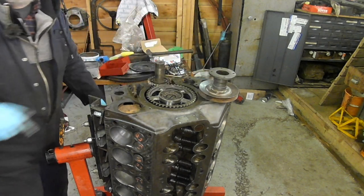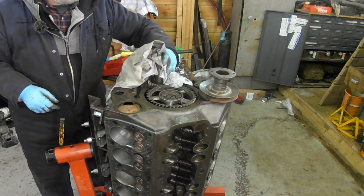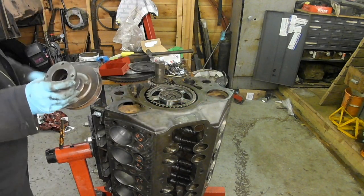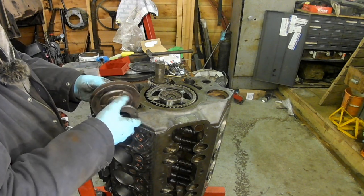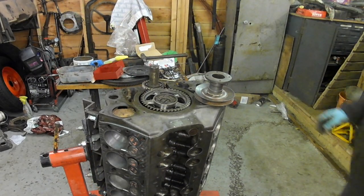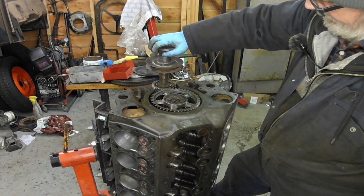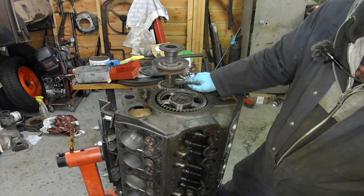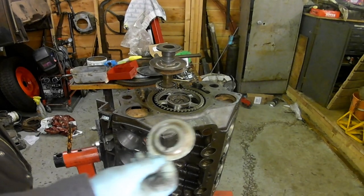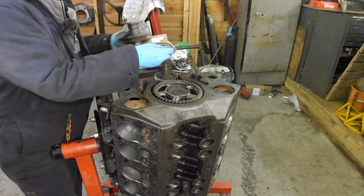I might just wipe and lightly oil the crank just to protect it, because it's been standing around a long time and has a little rust on it - I've cleaned it off with a wire brush. It takes ages cleaning up old parts. I put this on the lathe and one face was quite badly out so I was hitting it with a hammer to straighten it up. I need to put the slinger on - there it is, quite dirty. I'll clean it up with a wire wheel. It's cleaned up, not perfect, but it'll still act as a slinger.